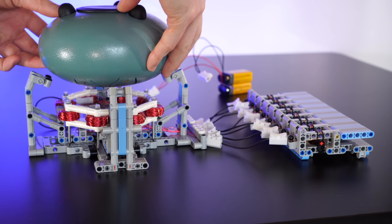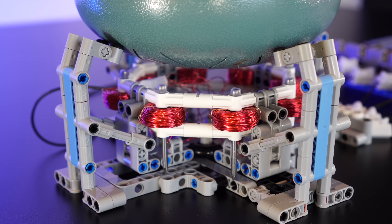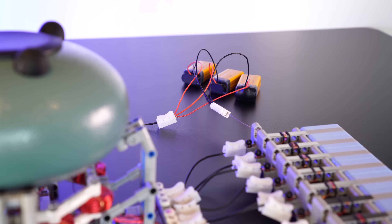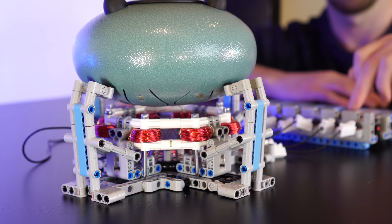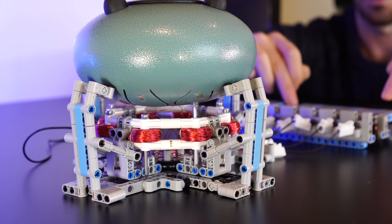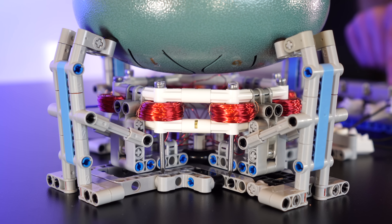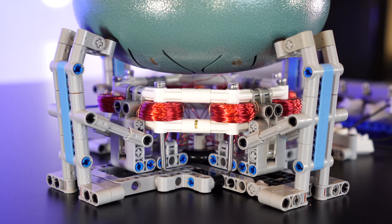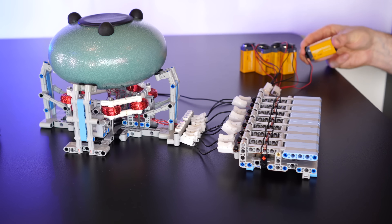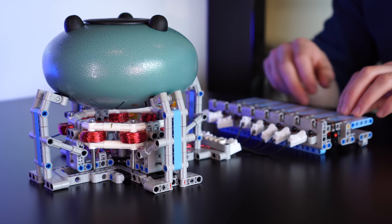Let's give it a quick try using a couple of 9-volt batteries - one end goes to the solenoids and the other to the keyboard. Now if we press each note, we get these lovely dancing little nails. I really love how responsive they are, and the bumpers on each nail also help to dampen the noise as each one falls back into place. It's still a little quiet though, so let's add another battery to up the current to the coils. Hell yeah, this is fantastic! It's so simple, but even just random tapping sounds lovely. We'll up it to 5 batteries just to make sure we get a good solid ring from the notes. With 5 batteries we also now have enough current to play several notes at once.